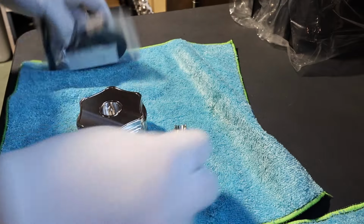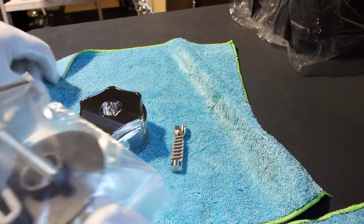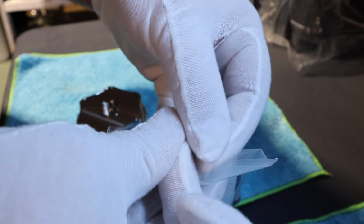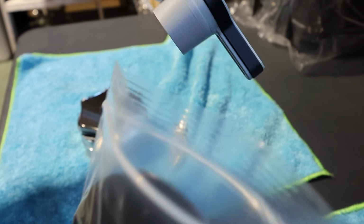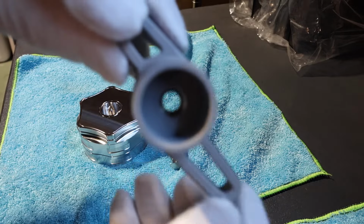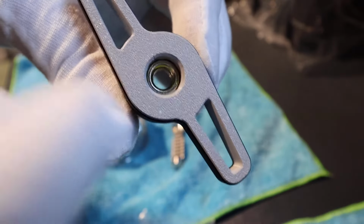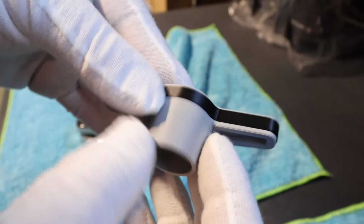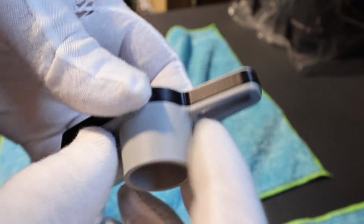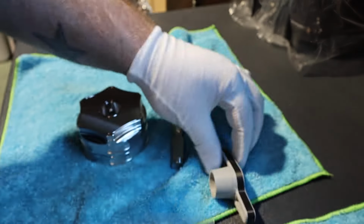So it's a spoon. Okay, and this is the new bearing tool. So this is bearing tool version 2. I'll give you a rundown on what I've done with this. So this is a new top section. The top section has a washer. There's a washer underneath that nut. So there's a nut encapsulated, there's a washer under it to stop them pulling through. The first bearing tool, there was a few reports of the nut pushing through. So I believe this has solved that issue.